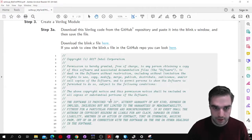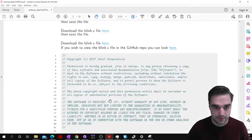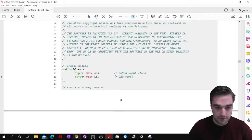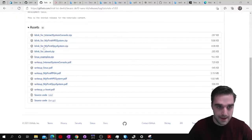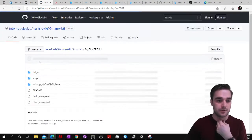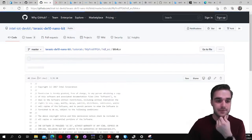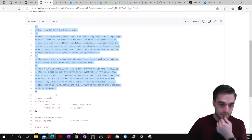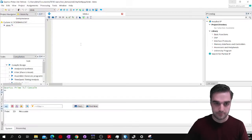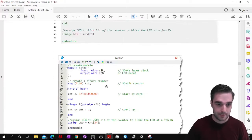So now we're going to create the Verilog module, and we're just going to copy and paste the code. And in the next video, we're going to dig into, they're doing some pretty advanced stuff. It's kind of difficult to really explain what all this means, but we're just going to copy in some code. So I'm going to go back to the repository. And I suppose if you have this cloned, you could do it from your local folder as well. The HDL source, that's what you need. And then you need the blink.v. And what I'll do is I'll go ahead and just copy all this code here. And then we'll go back to our Quartus and we'll paste it in there. And I'll do Control S to save. Very good. So now we copied in their example code.